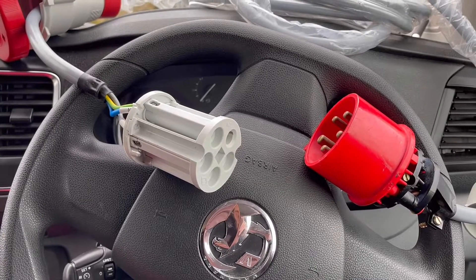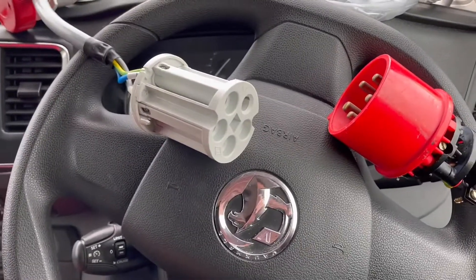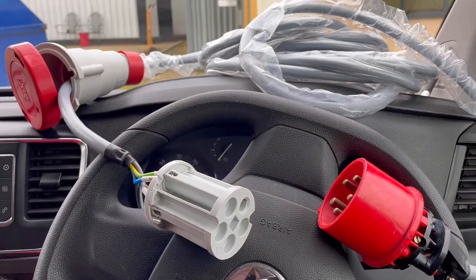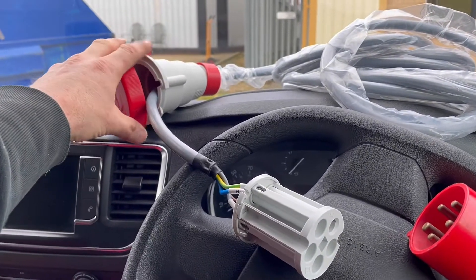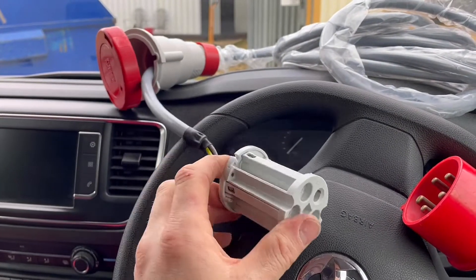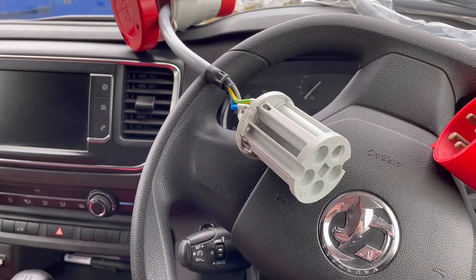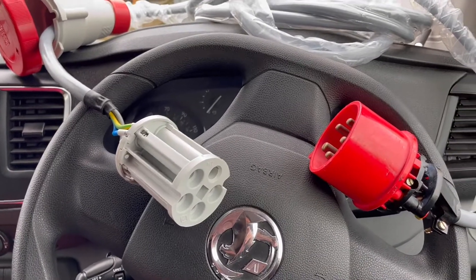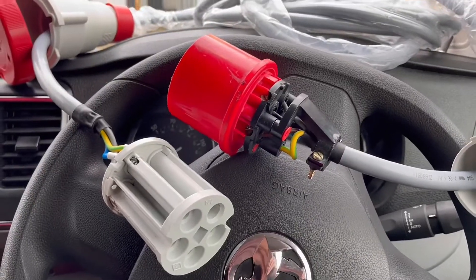The one in front of me is a three-phase socket — it's 32 amp and five pin, meaning it has a neutral as well. I'm doing this in the van simply because inside the factory it's a bit noisy. This is the lead that comes with the machine — it's a great big printer. It's a five-core lead that already comes with an attachment built onto it. This is the female end, which fits directly onto the printer itself. All I've had to do is fit a socket to go into the three-phase plug. We took a previous one off the machine, so we've just used this one.